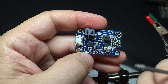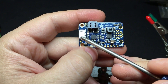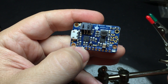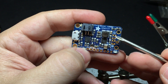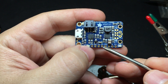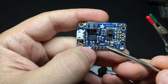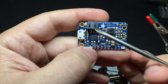This is the power boost board. What this does is it lets us charge the battery which gets plugged in there. There's a micro USB port for charging input but we're not going to be using that. We'll be using this USB pin right here which will be connected to our micro USB charging port. These pads here are meant for attaching a USB port, but instead we're going to connect directly to those pads and hook them up to the power strip that we made. The last thing we're going to use is the enable pin, which is what's going to be connected to the power switch. This thing can get pretty warm when it's charging — Adafruit says that's normal — so I wouldn't put any hot glue in the middle, just a little bit on the corners to mount it.